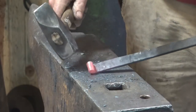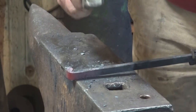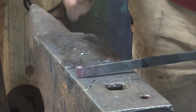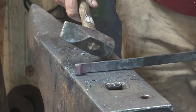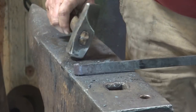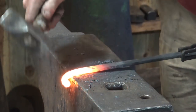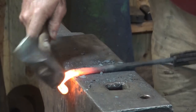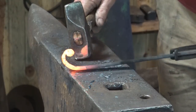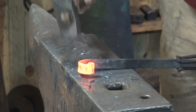This is a much nicer snub end than the first one because we were able to add extra mass by virtue of forge welding. If you watched my first forge welding video where we discussed a faggot weld — which is essentially stacking a bundle of things, in this case a bundle of two — that's what this would be as a faggot weld, and an example of why that's a good weld to know. Now I'm going to get it hot and start forming the scroll part. Now let's go to the scroll form.